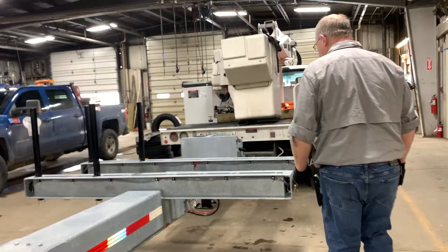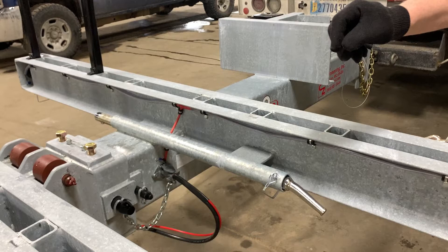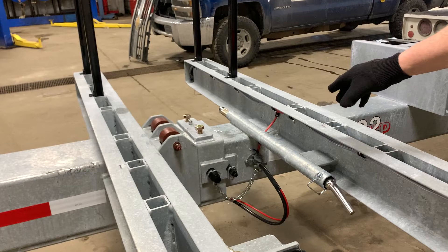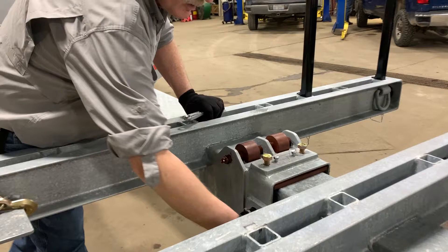The trailer is extendable in 30-inch increments. Here's the point where we do our adjustment. It's important to understand that our wheels are chocked on our trailer when we do this. When it's at full extension, provided it's decaled properly, there is a decal indicating you're at the last spot.